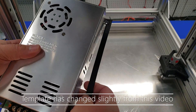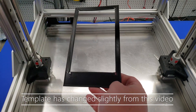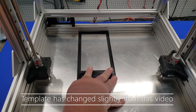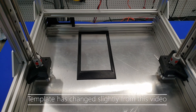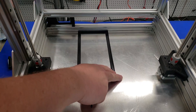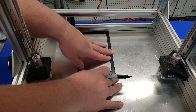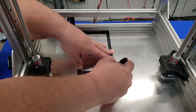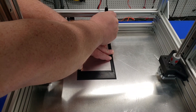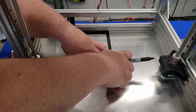In the 3D printed parts, you'll find this handy one-millimeter template that's going to allow you to mark the holes where the power supply is going to go in your electronics enclosure. For this build, I'm going to put one power supply in, but the build will easily support two — one for your heat bed and one for your main electronics. The thicker side of the template is where you'll screw down the wires onto the power supply. You can use the rear cover switch as a guide for placing the first and optionally the second power supply.